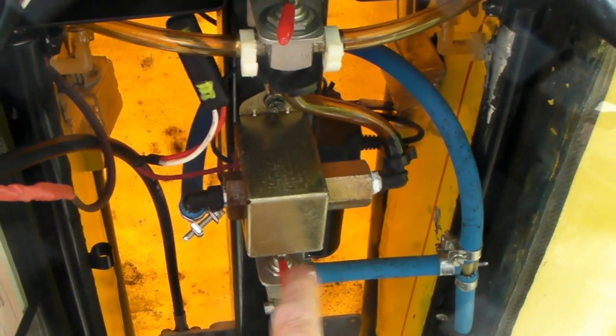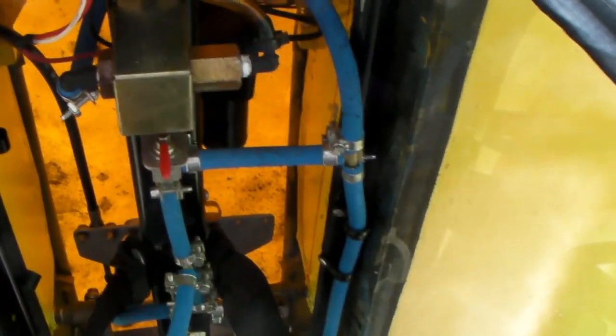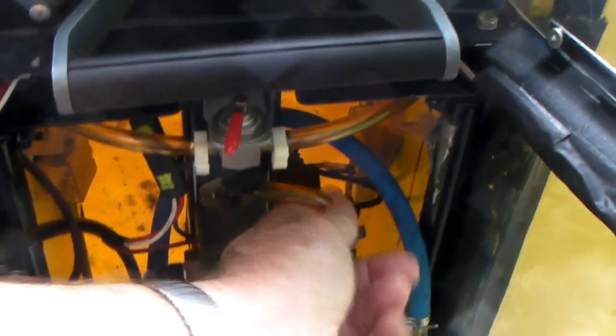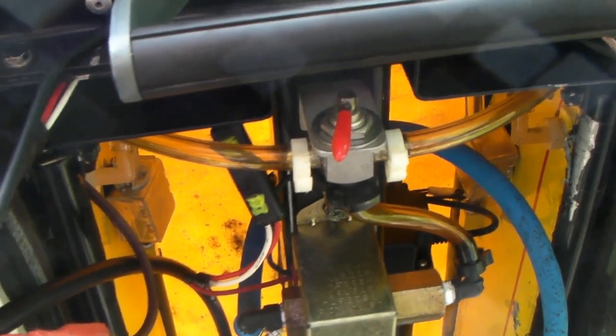This diverter valve sucks fuel from one tank or the other. This valve back here is just the master fuel valve, and that works on the big tanks in the wing — they work in common through a T-fitting. You'll notice these blue hoses; I'm getting rid of the clear stuff. It's okay for fuel transfer but I don't think it's dependable — it needs replacing pretty often.